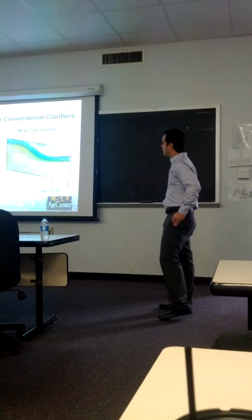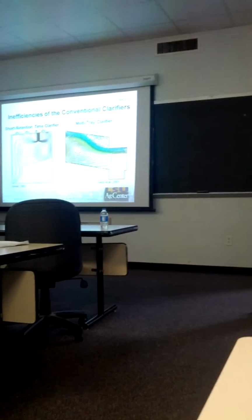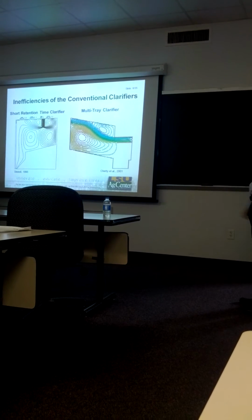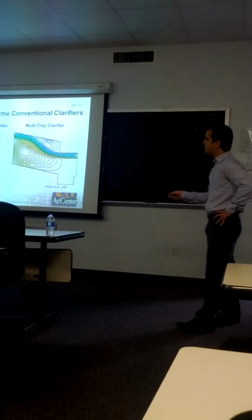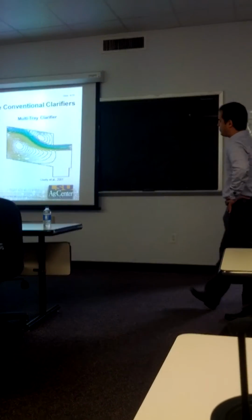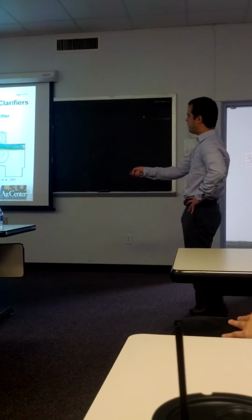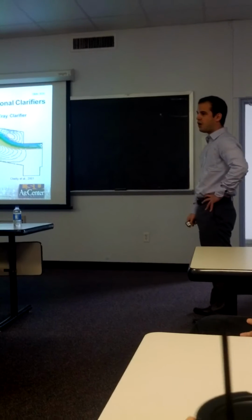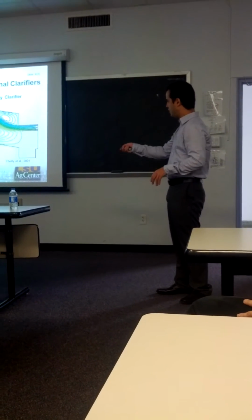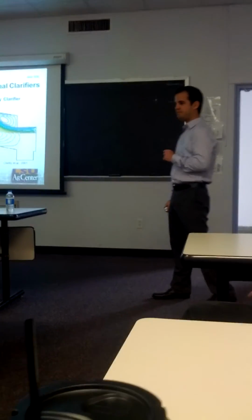These long residence times in the clarifiers occur because the juice that arrives to the clarifier is highly turbulent, leading to significant internal recirculations. These recirculations can be observed when two of the most popular clarifiers used in the industry for mixed-juice clarification or for filtrate are simulated with CFD.